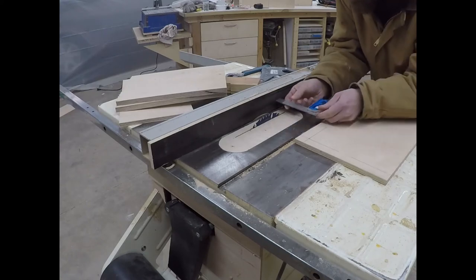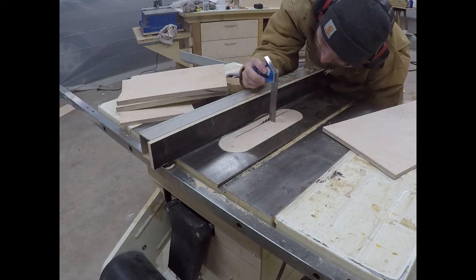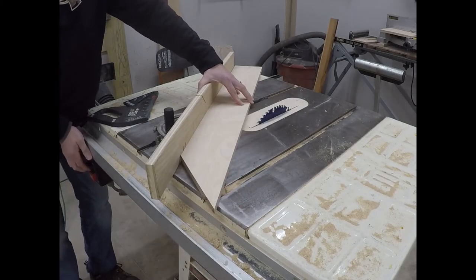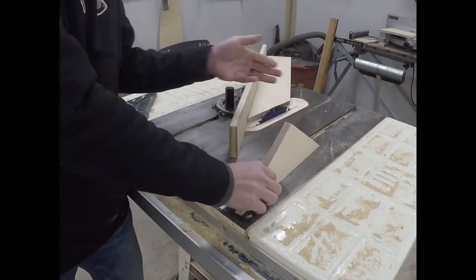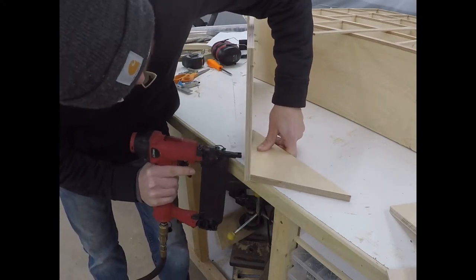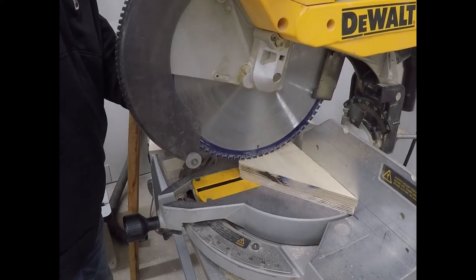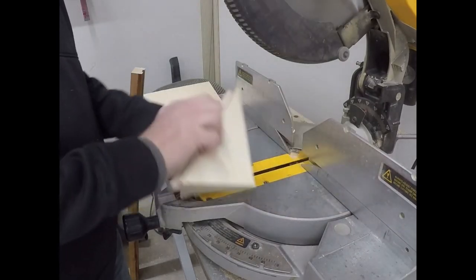With my helper going home for the day, it was time to start assembling the roof of the stuffed animal house. The first thing I needed to do was cut a slot about an inch in for the overhang. I'll take a piece of 1/8 inch plywood and put it in this slot as a backer. To mount the roof to the top of the house, I cut a couple triangular pieces out to fit in the peak and on the edges where it will meet the top of the house. I put these pieces on both the top and the bottom in the peak of the roof, holding them in there with some 18-gauge brad nails and some glue.